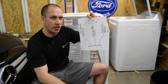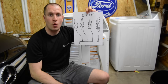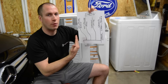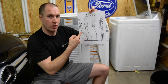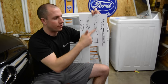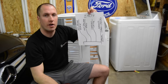So we're talking about dryer plugs — we're talking about a 240 volt circuit, or what some people call a 220 outlet. Basically this is adding an extra wire, and this is why some people get confused on a four-wire setup. You have a hot wire and another hot wire — one is red, one is black. Each of these wires has 120 volts, and 120 plus 120 makes 240. Then you have your white wire the same as before, and a green or bare wire as your ground.